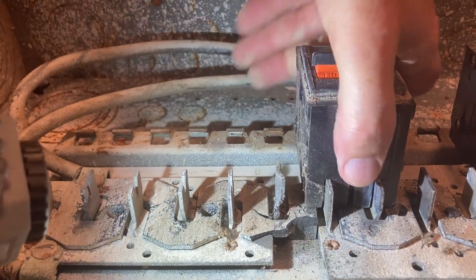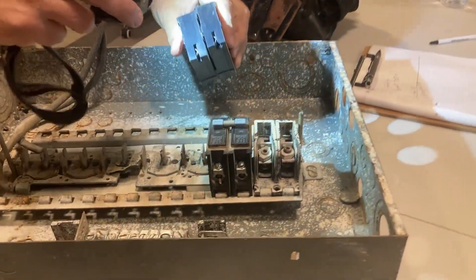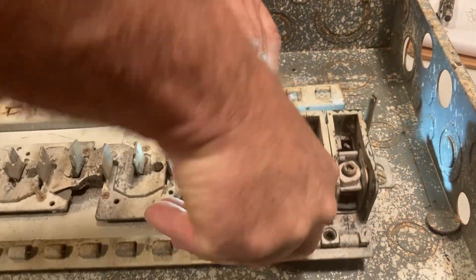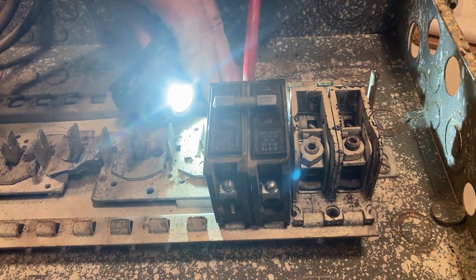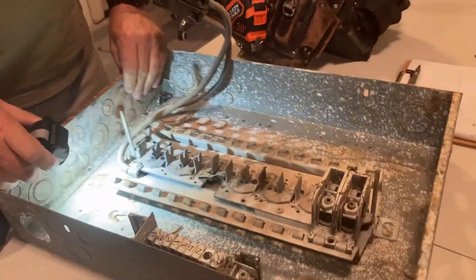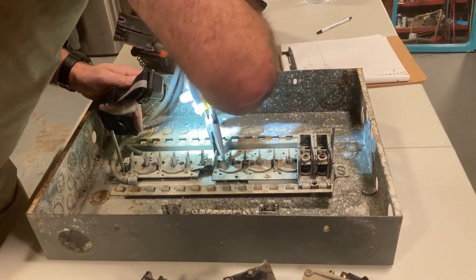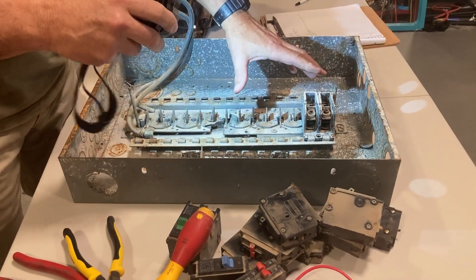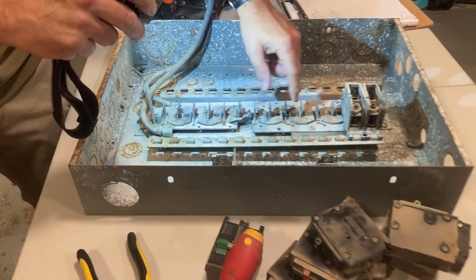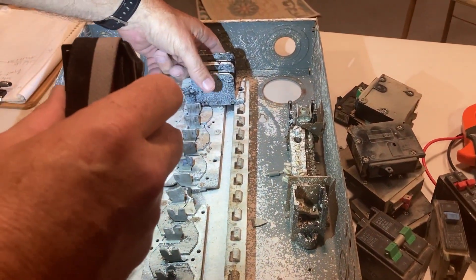This is the lower half main. Let's take this off. That one's not burned. So the post-mortem on this: top half with the 220s and utility feed, bottom half with the 110s — we had burning on two of the buses on the upper half, two burning on the lower half, plus the main feeder lug up top was burned out.